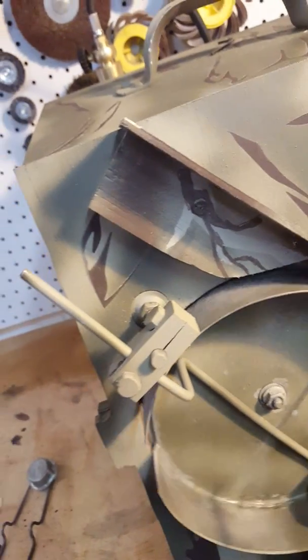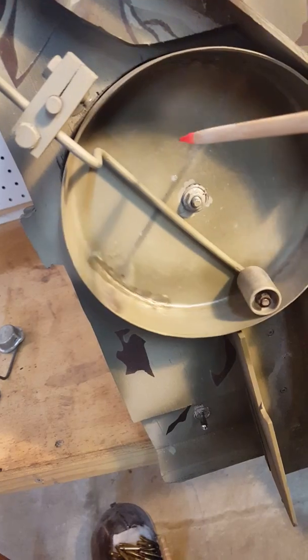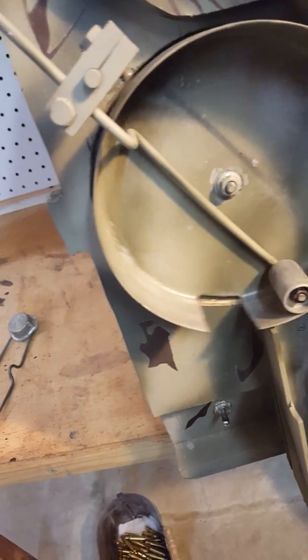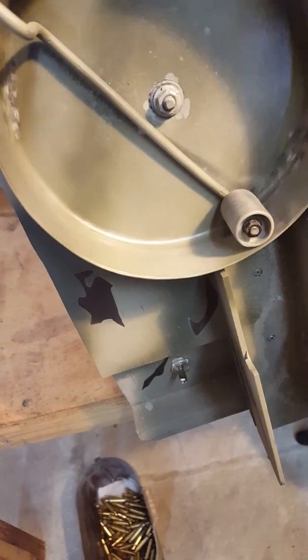If you notice how I built this thing, there's a piece of half-inch and a piece of quarter-inch, and that was done on purpose so I wouldn't have to space these things out. I marked center here and on this, drilled my holes with the quarter-inch piece clamped, then unclamped it. Marked a circle 6¼ inches in diameter, took a saw and cut it out. That allowed the release so we don't have feeding issues — you can see how it's below — and that dramatically improves feeding so it doesn't bounce and bobble around.